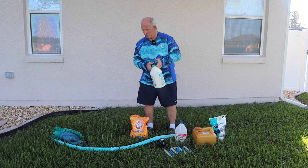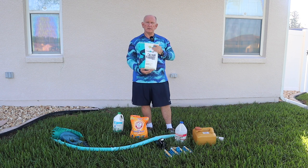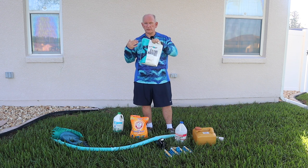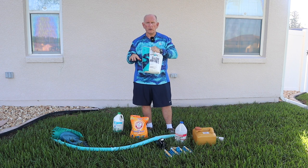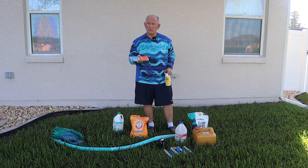This is called calcium hardness. When you have your water tested — which you should do maybe weekly or every other week — they'll tell you if your hardness is off and you need to add something. You can buy test kits to do the water testing yourself, but consider just taking a water sample to the pool place — it's free. Those people know what they're doing and will tell you exactly what you need for your pool, how to put the chemicals in, and at what rate. Some of them you need to mix in a pail of water first.